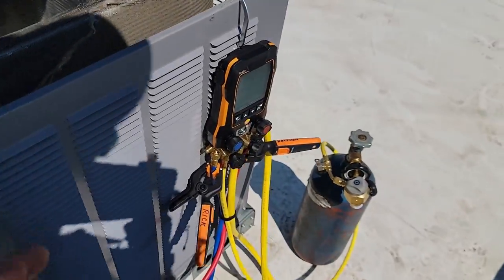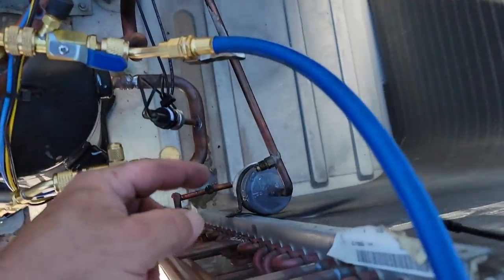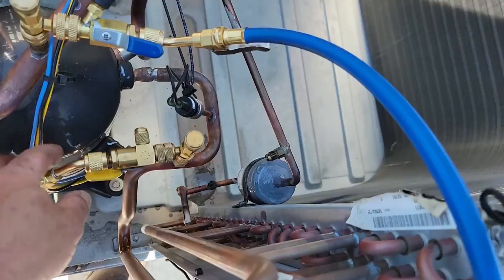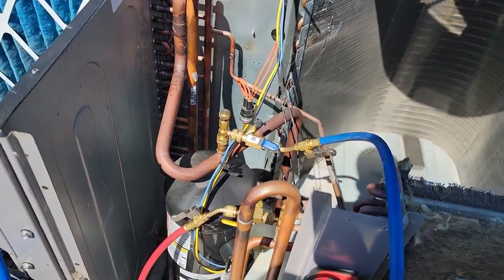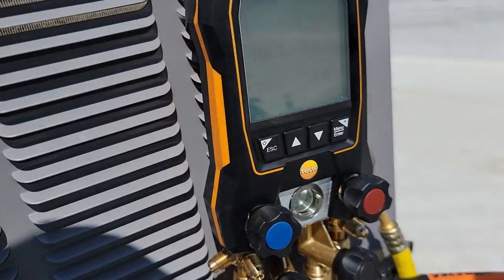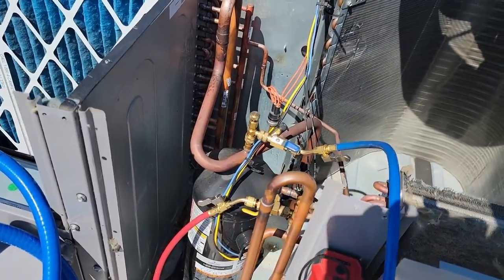Just put a pressure test on it. It didn't go real super high. We got 115 on there. Sprayed all my joints. Nothing's leaking. So either we're leaking through this contraption or something, but the vacuum started rising right up really fast. We're holding right in there at 115.7. I don't know, 17 minutes, it should have been a lot lower than what it was.